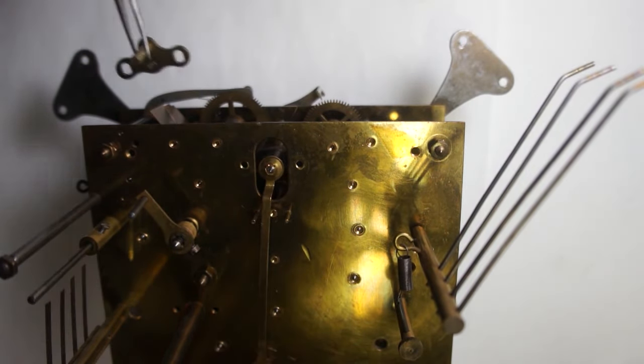Okay, that's real close now. I'll take it out of here and use my staking tool and press it on there. So I've got this screw so that it's fitting really tight. It'll be a friction fit in there. And then I've got a hollow punch on this staking tool. Press that in there. That'll make a lot nicer looking knob than just that raw screw on that door.